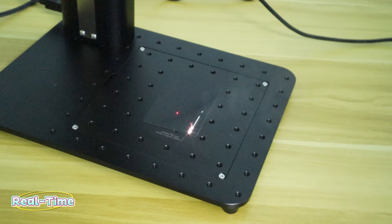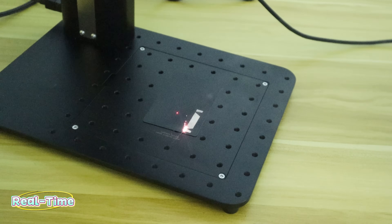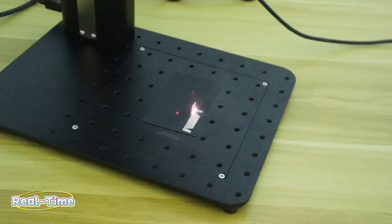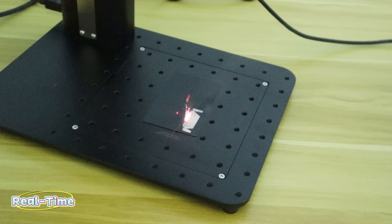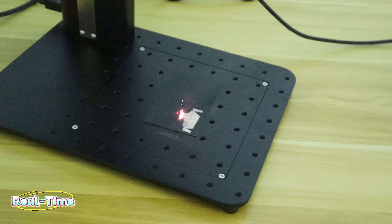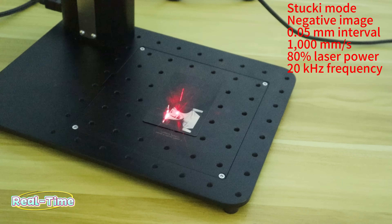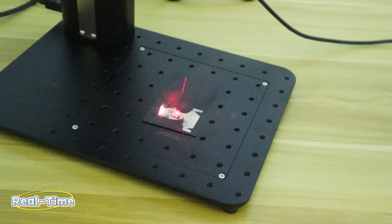The Handsmaker F1 Pro 20W fiber laser engraver has an engraving accuracy of 0.001 mm and a laser spot size of only 0.045 mm, which is excellent for ultra-fine engraving. With the right parameter settings, it will give you high-definition photo engraving. I did the photo engraving on a black business card, and as you can see, the engraving speed is very fast. I set the engraving parameters in LightBurn as stucki mode, negative image, 0.05 mm interval, 1,000 mm per second, and 80% laser power.